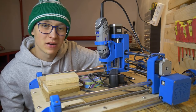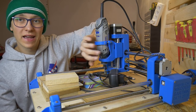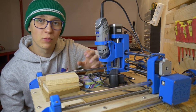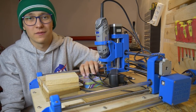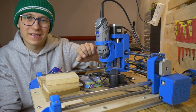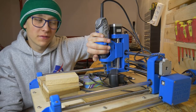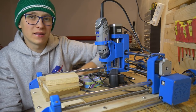Unfortunately it's not perfect. There are a few downsides. The first is the mounting system — it's not easy to mount to the CNC. I have this 3D printed mount and I kind of like it, but it's not the best option. The second thing is the bits you can use with a Dremel — only bits with a shank of one-eighth of an inch, which is small, so cutting bigger objects takes a lot of time and isn't efficient. And the last thing: I've read that the bearings inside are probably not that good, and after some time you have to replace them, but replacing them is super hard so you most likely have to buy another Dremel. I haven't faced this problem myself yet — Dremel works great for me so far — but keep in mind that maybe the bearings inside aren't that great.